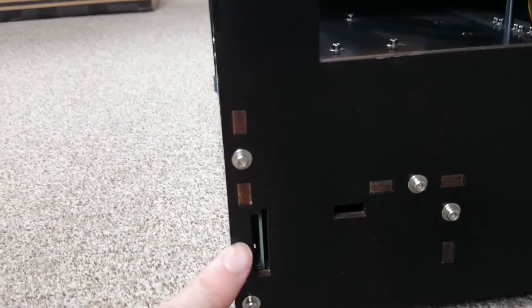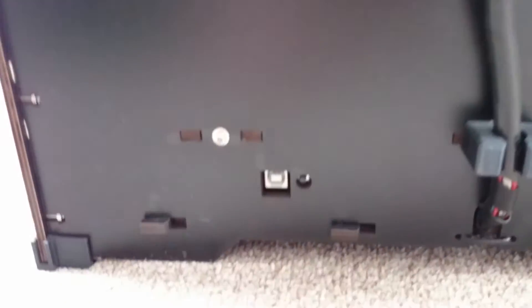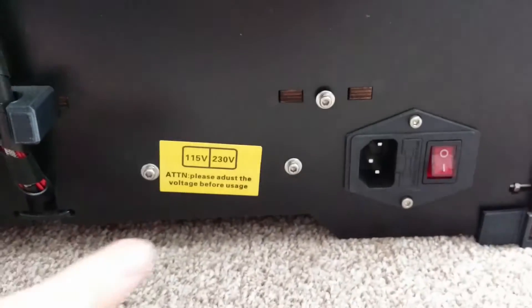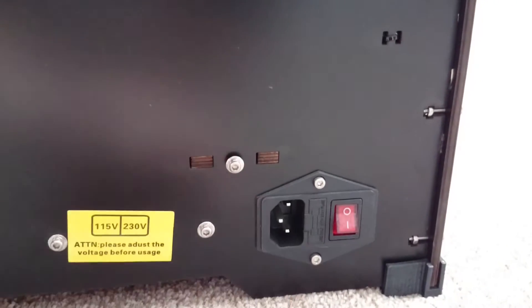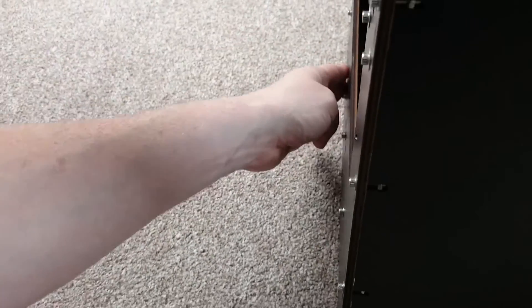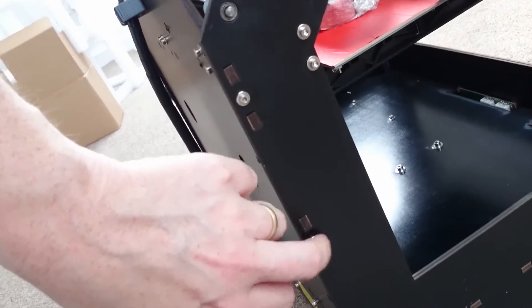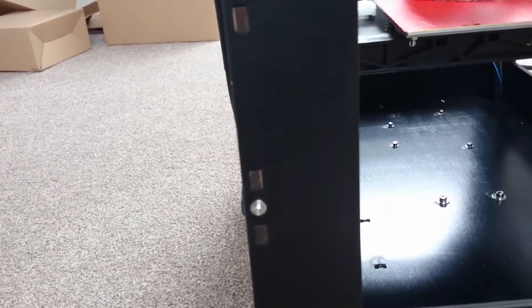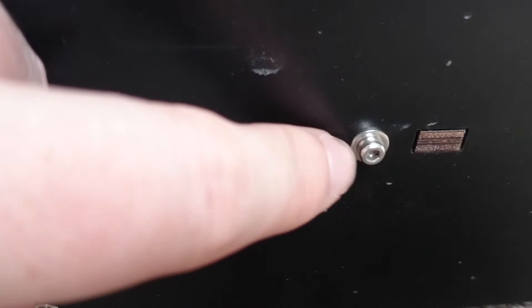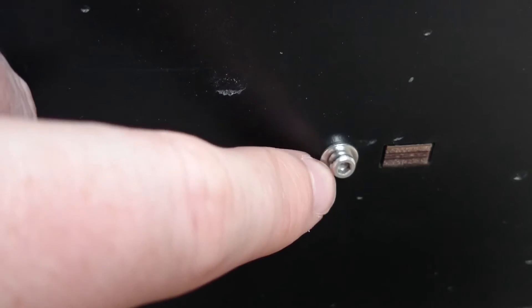On the side of the printer you can see the slot for the SD card. On the back you can see the USB port and beside it the power connections. It's worth noting that on the bottom there is a very small switch to switch between 110 and 240 volts. I would also recommend going around and checking every single screw on the printer, as from what I've read online they sometimes ship with very loose screws — there's one here that is extremely loose. It's laborious but well worth doing.